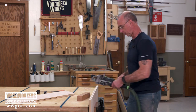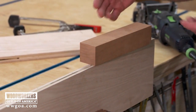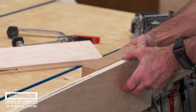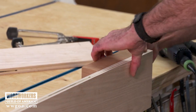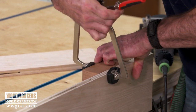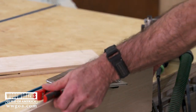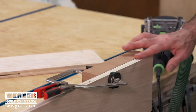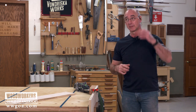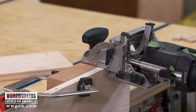There's a fix you can do for this that's pretty easy and straightforward, and that is simply have a piece of scrap. The problem is this is narrow, it's thin, so let's make it bigger, let's make it thicker. Take a piece of scrap, make it flush with the top edge, clamp it in place — just double checking to make sure it really is flush. What that's going to do is simple: it just gives us more surface area for that fence to sit on, whether domino, biscuit joiner, or dowel machine.